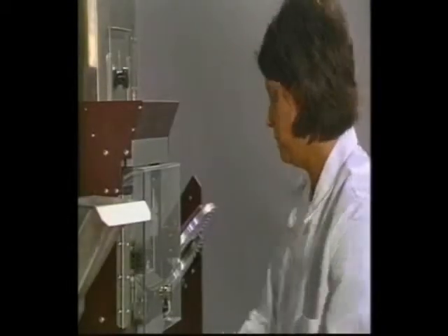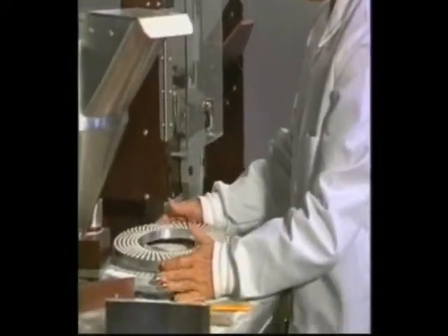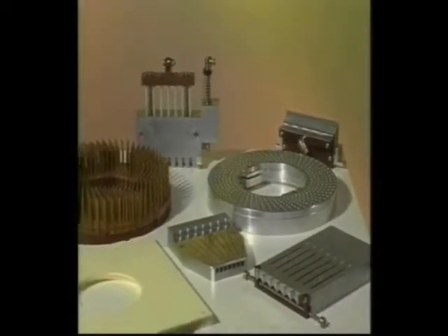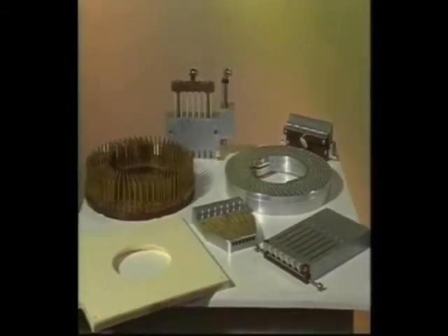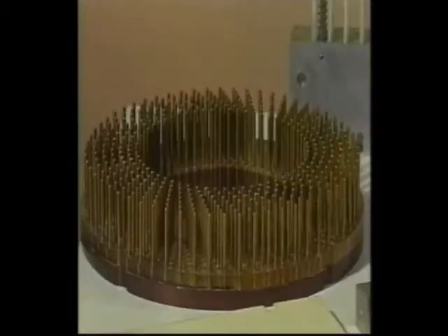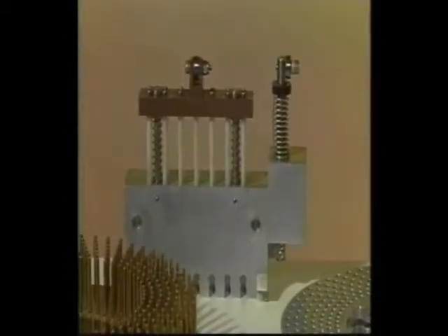The machine exhibits flexibility to handle various products and capsule sizes, but in order to fill a certain size capsule, you need to use the correct size machine parts. We referred to these machine parts as a change set — a set of parts for the rectifier, the closing station, and new capsule rings that allow you to run different sizes of capsules through your machine.